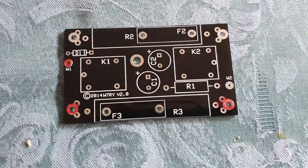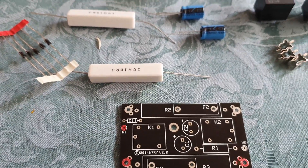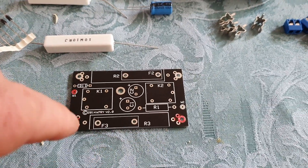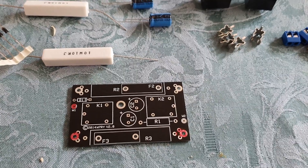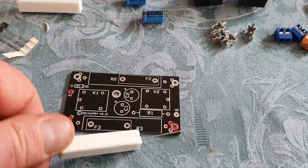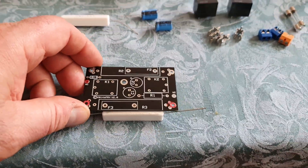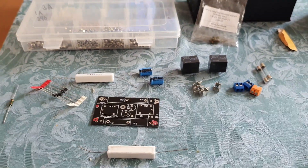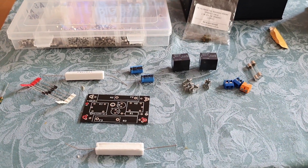Here's the board. It's relatively straightforward - this is the new update version. On this board, we're going to put the ceramic resistors, the 10 watt 10 ohm, underneath the board, not on top. We're going to have two fuses, F3 and F2, on the top side of the board, and the ceramic resistors will be what the board sits on underneath when we're finished populating. I'm just going to quickly populate this board and then come back and show you the installation process.